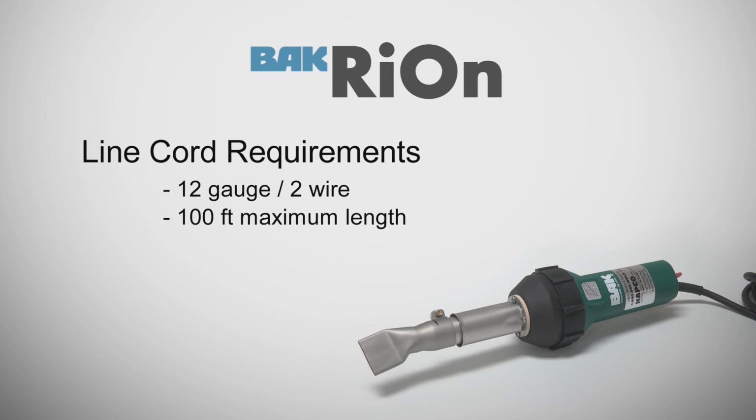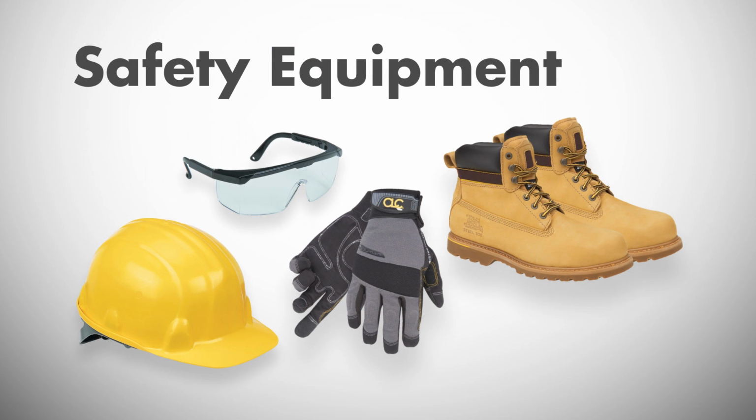It is recommended that 12-gauge 2-wire line cord no longer than 100 feet be used. Using the proper line cord is important to prevent damage to the heating element. While working on the roof, items such as hard hats, gloves, safety glasses, and closed-toed shoes are often required. Check all local safety regulations to ensure proper attire is worn on the roof.